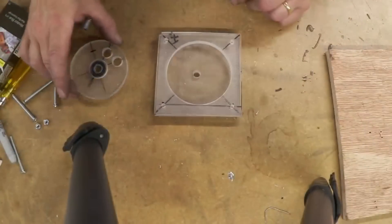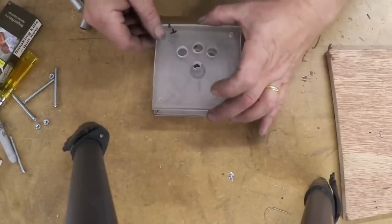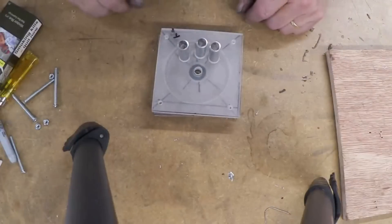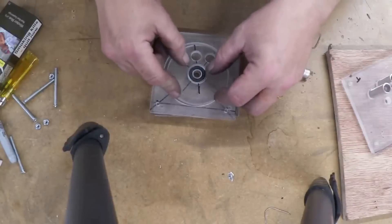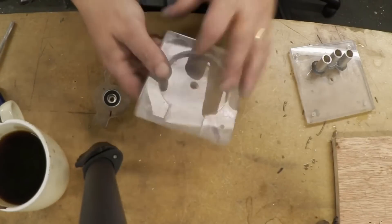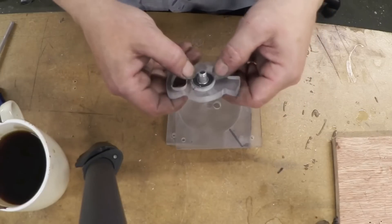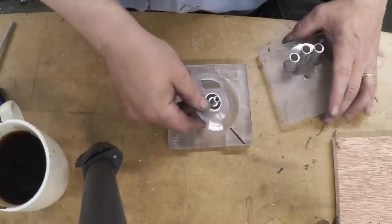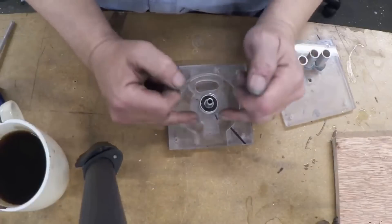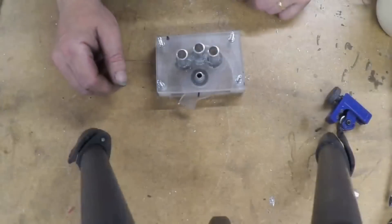There's the back plate, that's the chest. Now we've cut out the centre hole, and you can see that the centre disc - I've cut that out to 22mm and put a skater bearing in it. That's going to go in there. And there's the front part of the chest with its three holes in, and then those three port entry pipes go in there like that. So now we can assemble everything, and then we need to be able to cut around here to allow the gas to escape on the exhaust, and then we're finished. I've fixed the central piece and the back piece together. There's the bits with the ports in there, and there is the valve wheel that has been shaped with its bearing in the middle. So now all I've got to do is put that together and see where it fits. It's going to waggle that little bit there, and as these actually are exhaust ports, anywhere along there can get chopped off to expose that little section, which is going to be the section that connects to the piston. So that's the valve finished.